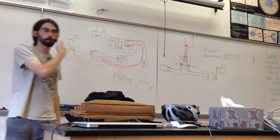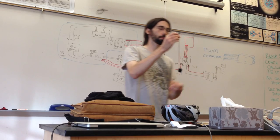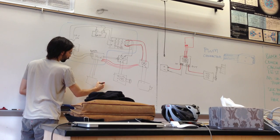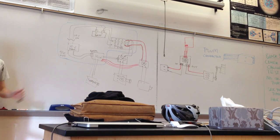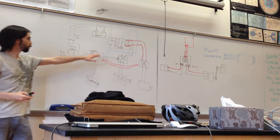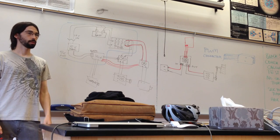The one exception is if you're using a servo motor. The servo motor doesn't actually require a controller — it's powered entirely through the PWM connection. If you do use a servo, it's really simple: the servo just plugs directly into the receiver and you're done. It actually gets its power from the five volt regulator directly through the receiver.